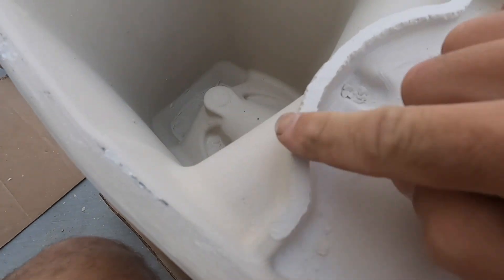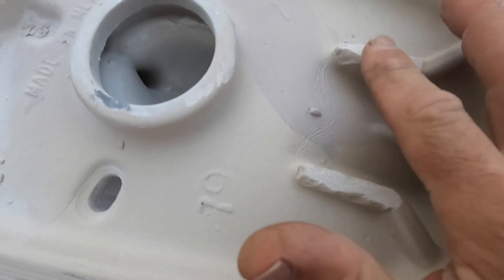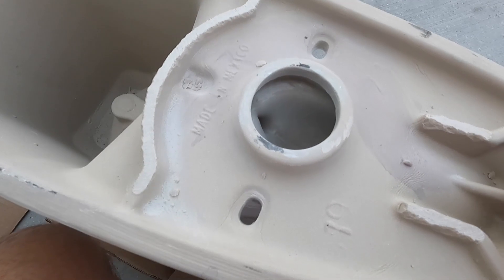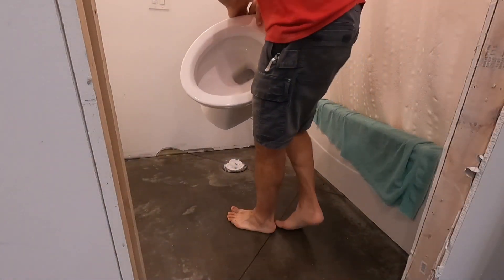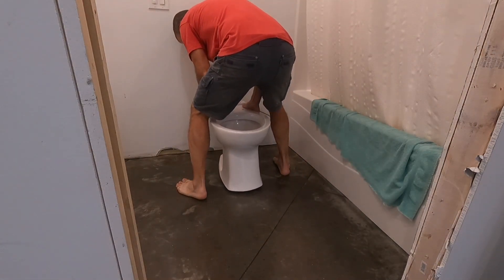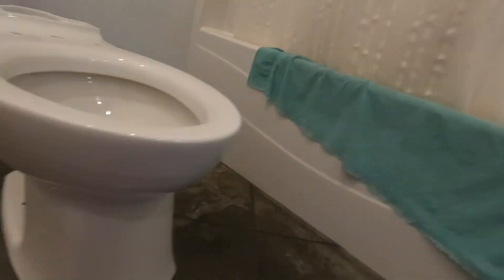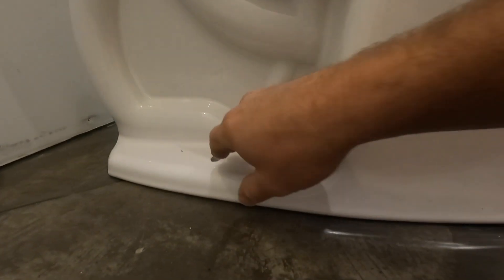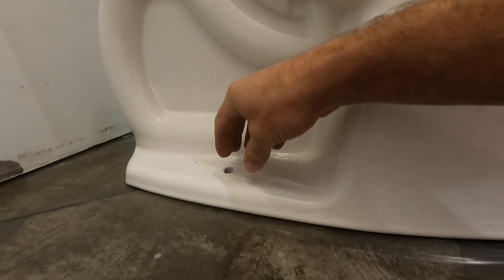I've got this ground down to where I think it needs to be — that one and that one — so this edge will touch everywhere, making it really stable. There might be just a touch of space right here, but it sits really, really nicely. It was really wobbly side to side before I did that, but once I put my wax ring and bolts on there, I think this is going to sit really nice.